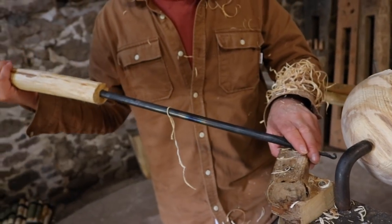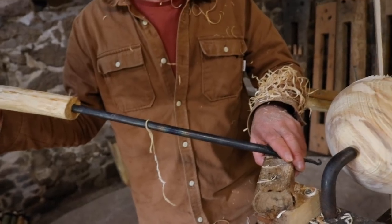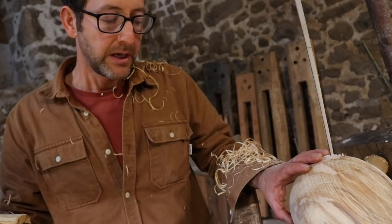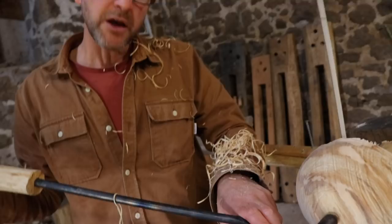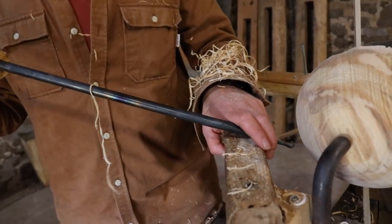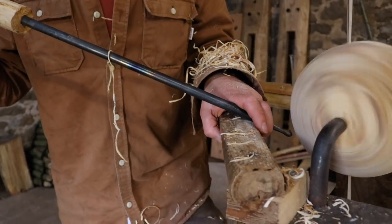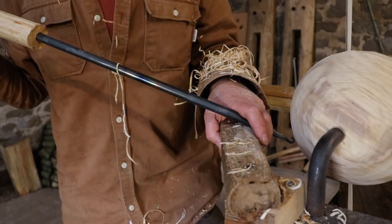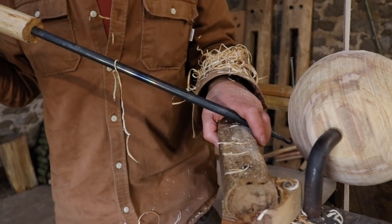If you're trying to move too fast, you can get into problems where you're trying to take off too much material, essentially, and you get a wall building up. Or you start knocking into high points. So if you feel it knocking or biting off too much, you can keep the leg moving, keep the revs up, but just stop the tool moving forward at all. Just leave it there where it's knocking and let it knock away what it's trying to work against.